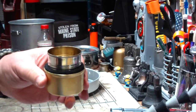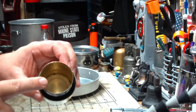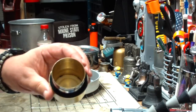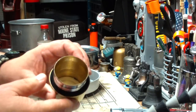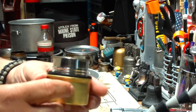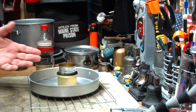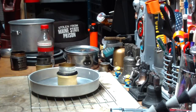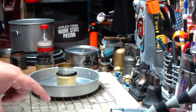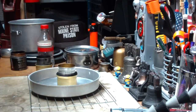So what I did was put together another stove. I think this was an 8-ounce tomato sauce can, cut off so that it's about 1 inch from the wick to the bottom of the pot. There are holes in the bottom so that the alcohol can get to the wick, but this time I didn't punch a vent hole. I'll do a little video here to see if it happens - with Murphy's Law it probably won't - but I'll set up camera 2, get alcohol in, get it to the wick, and be right back.